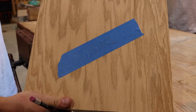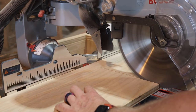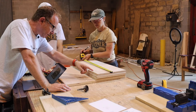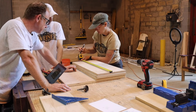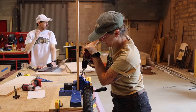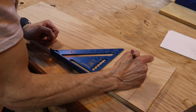Here's a little trick when cutting plywood on your miter station: score the top of the plywood about a sixteenth of an inch before doing your final cut. That'll take care of chipping and give you a nice clean cut. Holly came in and helped out, and at this point she pretty much had enough of Adam's and my shenanigans, so she took over measuring. We're using pocket hole joinery for this build because it makes quick work of assembly — Holly just kicked us out of the way and drilled the pocket holes herself.